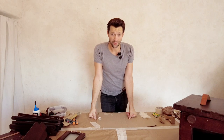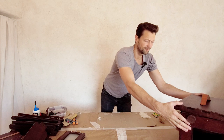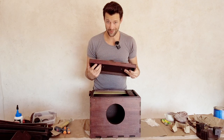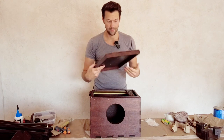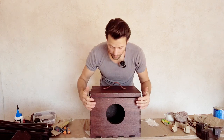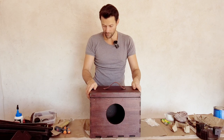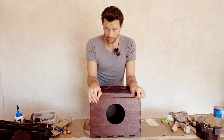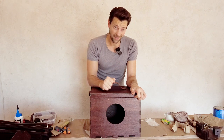Let's put together the box — place the hinges, closing mechanisms, back door, and corner protection. If you installed it correctly, you have markings on the outside: three markings on this side, and two and two on this side. Where there are two markings, the corresponding part goes here. On the back are the hinge markings. If it goes in really with difficulty, that's maybe because of too much varnish on the side — sanding is the key.